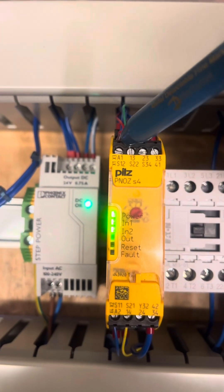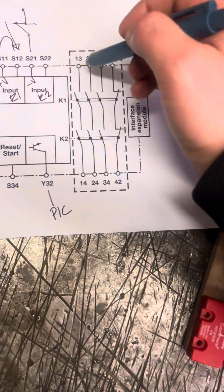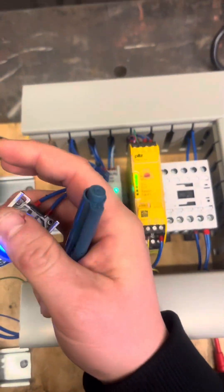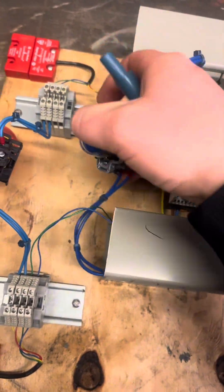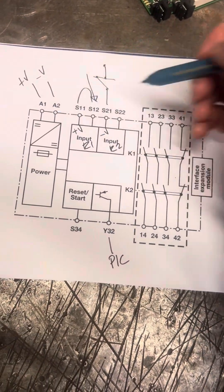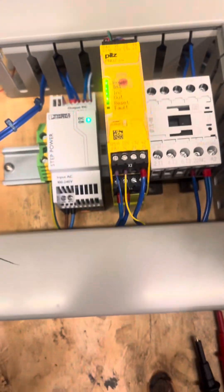The reset also goes through your normally closed auxiliary contact of anything that's been fed through these contacts. So once this pulls in, it turns that to normally open and then you can't reset it. You saw that flash of the reset and then our output is showing the contact has now been pulled in — I can't reset that now. Normally we do it this way because these buttons are going to be outside the panels. It takes 24 volts to here from your A1, which is then fed through the button.